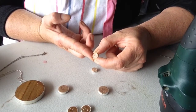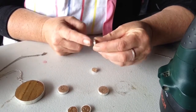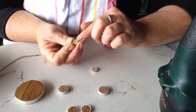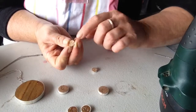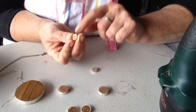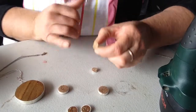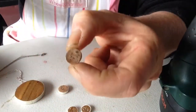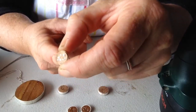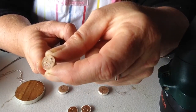I have already started the process of inlaying the silver on these, so I'll show you how this is done. For the earrings in particular, I use a sterling silver bezel cup, and I actually turn the Rimu on my wood lathe to get it the right diameter to fit really snugly inside the bezel cup. I also use silver pins to keep it in place, and then I inlay silver wire — fine silver wire — into the Rimu.